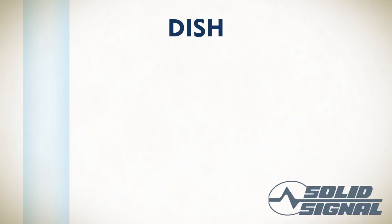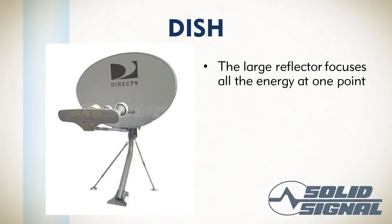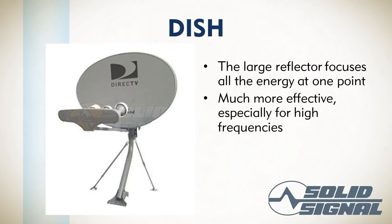The last type of antenna we're going to show you today is the dish, also usually called a satellite dish, although it can be used for anything. The difference with a dish is that large parabolic reflector, which takes in a lot of signal because it's got a lot of surface area, and focuses it all at a point right in the front. The power from satellite dishes — because they're 22,000 miles away — is very, very low, so you need a large parabolic reflector to collect and focus that weak signal on the antenna at the front, which in the case of a satellite dish is called an LNB. A dish antenna can actually be used with UHF, VHF, and can even be used to help pick up sound.